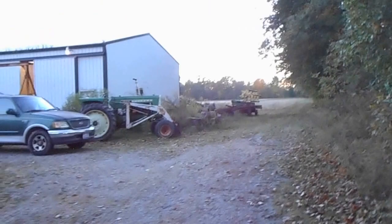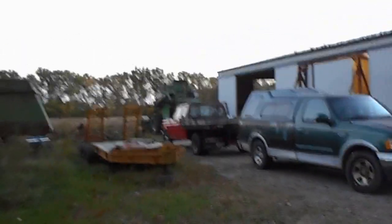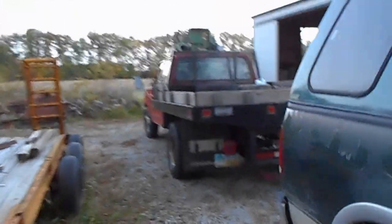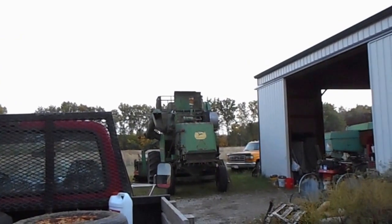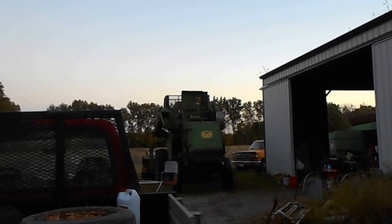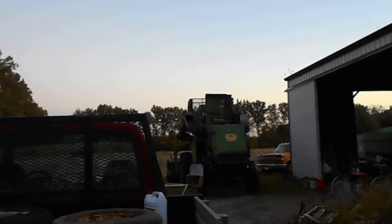So I think this is where my day ends. Get stuff put up and call it a day. I really, really hoped that flushing the radiator would solve the problem. I had to try it before I take the water pump off. You know, went uptown to get new fan belts for it, and nobody has a 40 and a half belt, or a 41. 39 and a half is too short. 41 and a half would have worked, but no, they don't have them.